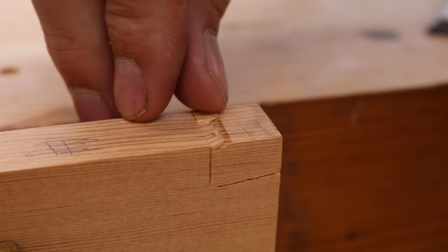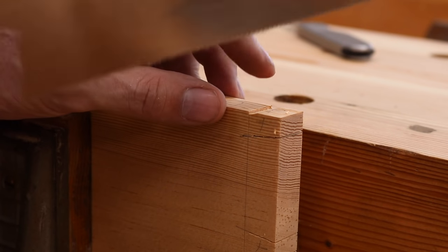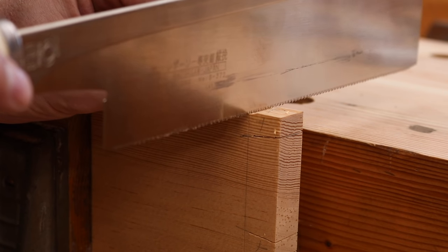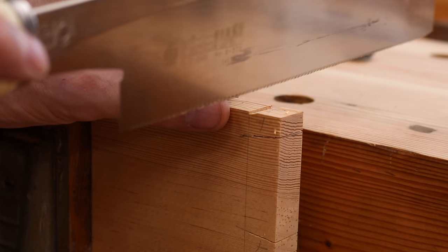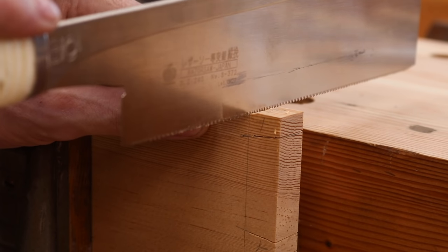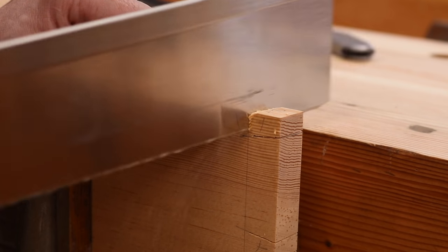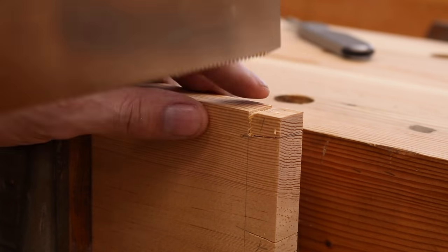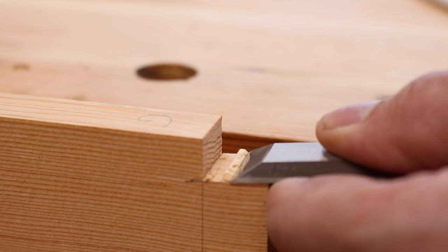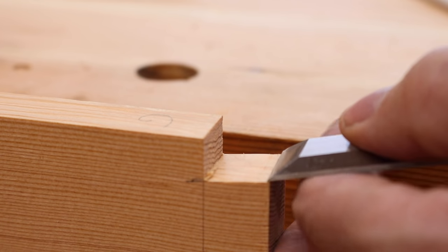Flick that out of the way — this gives us a place to start the saw. Now we're ready to saw. You can see why we use that knife wall: it gives a clean edge. Even the best saws will leave a little bit of a fuzzy edge, but now we have a reference. We index the saw right up against the side of that wood. This is really important — we've got to cut right down that line. Now we'll use our three-quarter-inch chisel to clean up any roughness or inconsistencies left by the saw teeth.